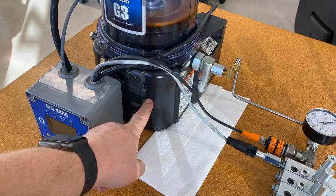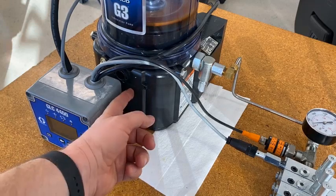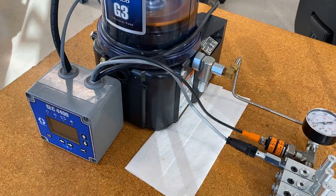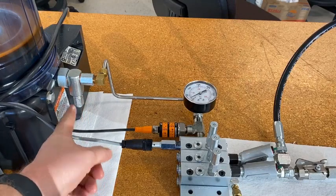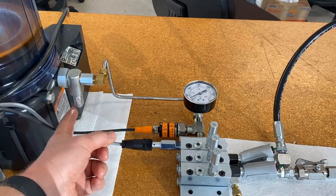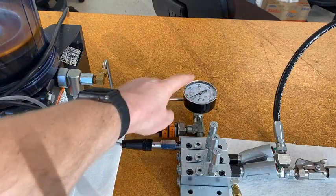Along with that, we need a pump without a controller. For a G3, you're not going to be able to use a G3 Max or a Pro with broken line indicators — you'd have to use a G3 Standard. But there are a lot of other options for pumps without controllers. Coming over here, we see our relief valve. This is really important, especially when you're talking about a system that can have high pressure — you need that relief valve to keep your tubing from becoming your relief.